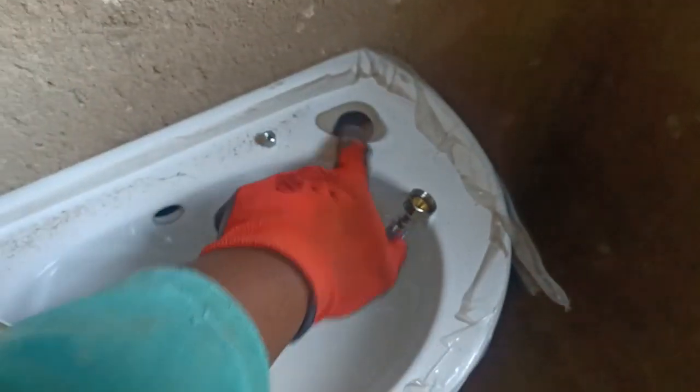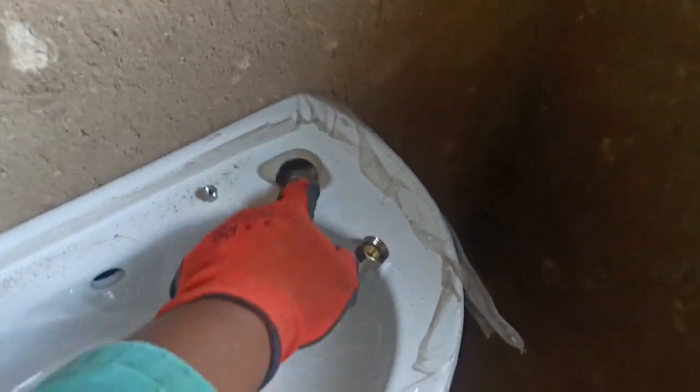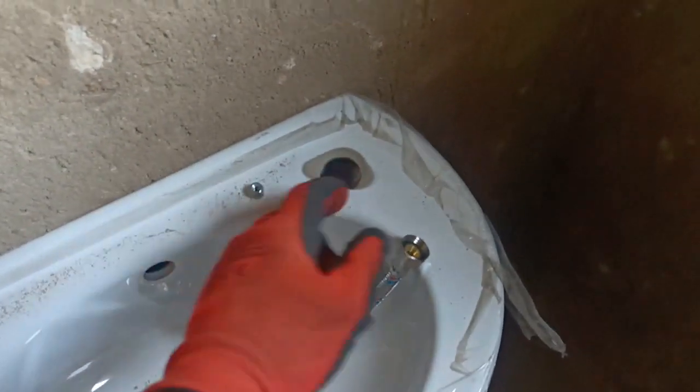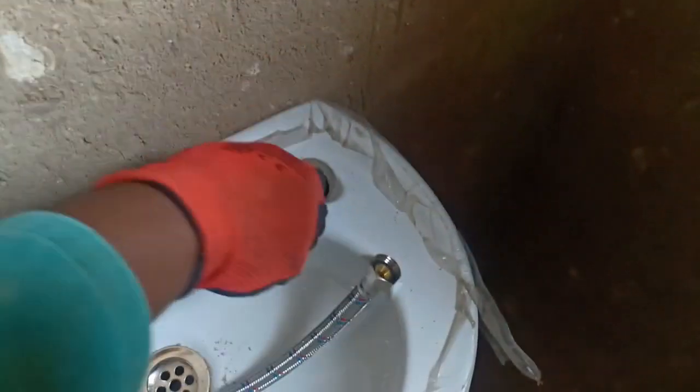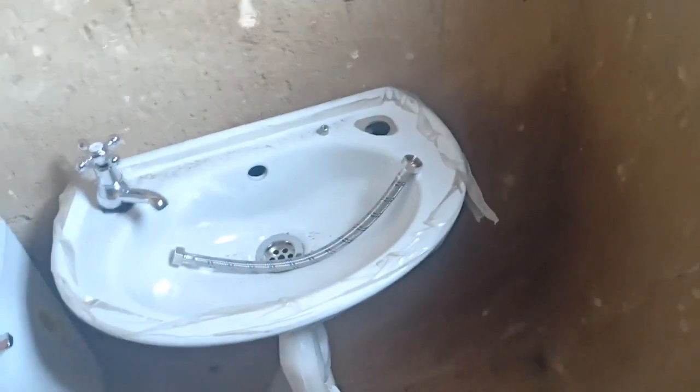We've got a tap in here and the basins are in, but I made a mistake with making the holes. I didn't know how you actually make these holes, so I tried doing them from underneath. That doesn't work. You actually have to punch it from the top, then it comes out okay. So I got to learn that the hard way. There's one basin that's messed up a bit more than these, but this is still workable, I think. So I'm just going to leave it as it is.